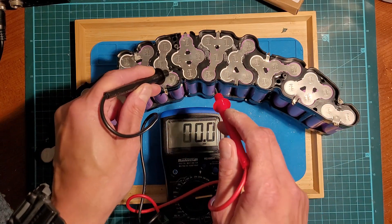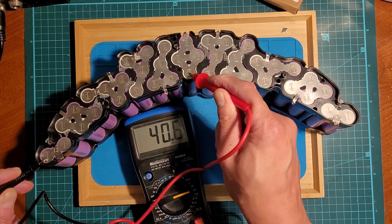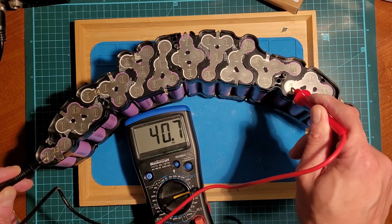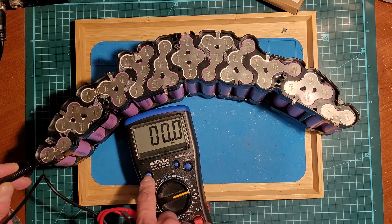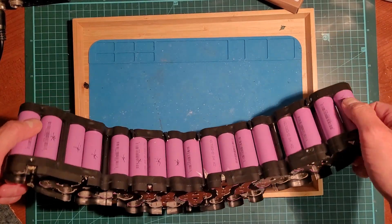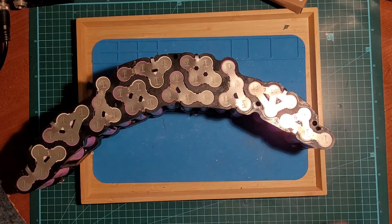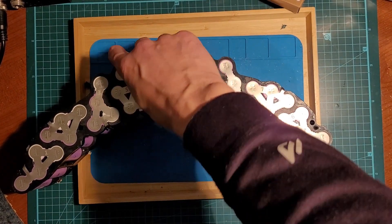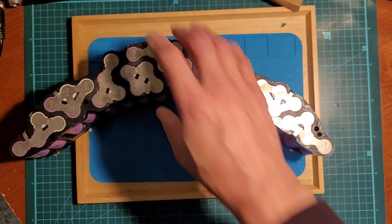So are these all zero-volt cells? It's still passing through the voltage but the full pack is only 40 volts — it should be 72 volts. The voltage goes to 40 here and then stops going higher, but it's still conducting all the way through. I've marked the ones where the voltages stopped increasing with an X. Dismantling this is kind of difficult — the flat side is easiest but the other side is recessed, so it might be hard to get the cutters in due to the lip on either side.